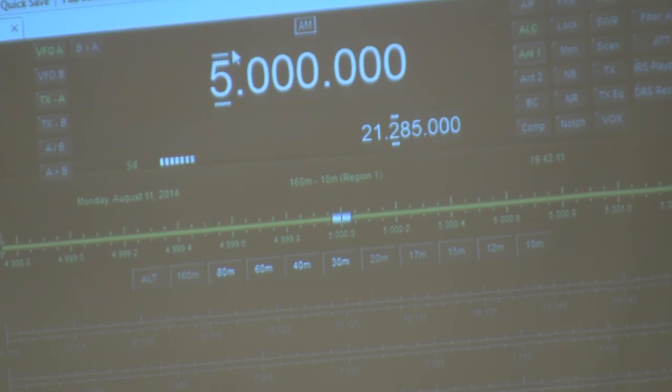Go up to CHU at a higher frequency, 7850. And now the S meter caught up. S6, S8. Switched off the back. It's not showing much difference tonight. Oh wait, I didn't switch. There you can see it. Again, the propagation changes. Sometimes it's different. That's toward the station. That's away from the station.